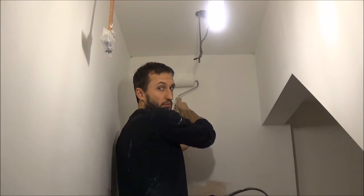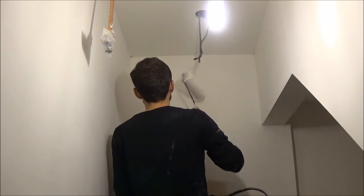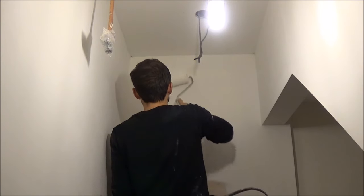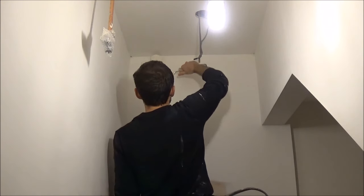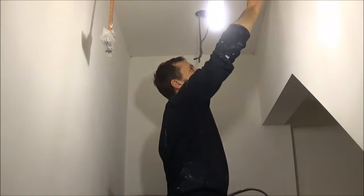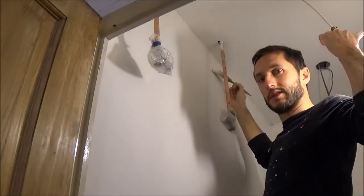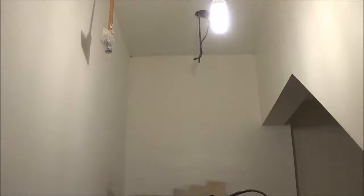Don't splash — put fresh paint on the roller and gently apply it to the wall. Once the paint is off the roller, go along the top and just take out the brush lines with the roller, being careful not to touch the ceiling. The final coat of paint is finished — this wall is an off-white and the ceiling bits are white, so you can see the separation.